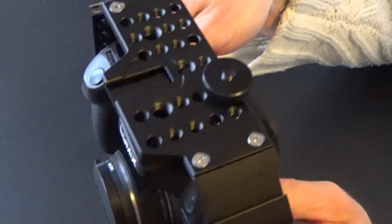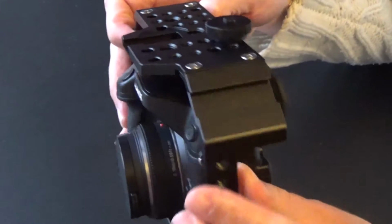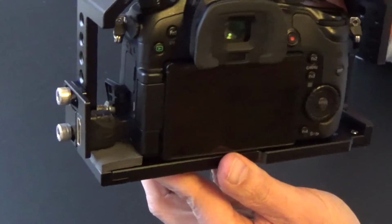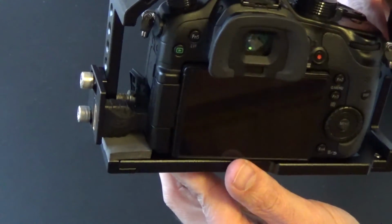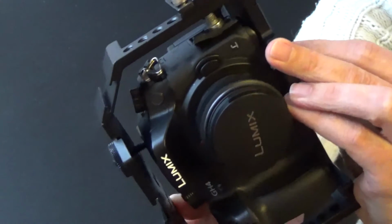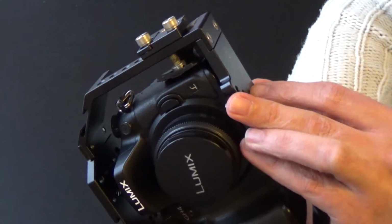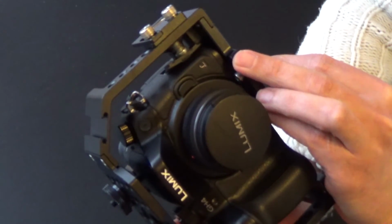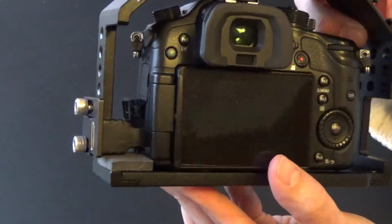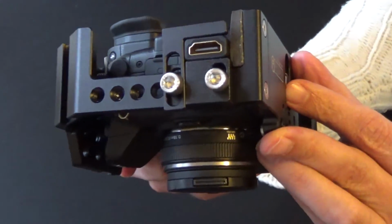I'm in Europe, so I had the camera in PAL, in 50p. But that was still not enough. I had the recording settings on HD or Full HD. I think 100 or 200 megabits is nothing really extreme, but I had to toggle it back and forth, and now I set it for the moment on 50 megabit recording, and then it worked. So you can access those through the quick menu, if you haven't modified it. Just access your recording settings through the quick menu and fiddle a bit with them back and forth, and then the output right here, full HDMI, should work.